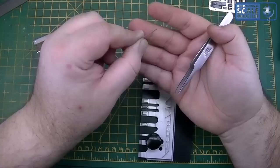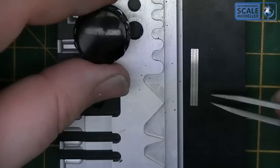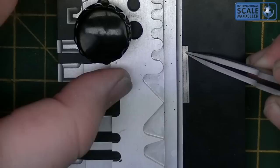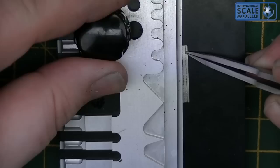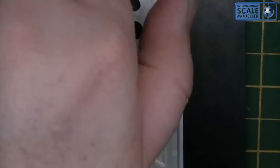So this is where we need to go. I need to try and keep you guys in shot. It's a case of lining up those perforated holes with each side of the machine. What I did was so I could just see the hole. Tighten that side up so it's nearly tight. Push it in so it's straight. Tighten it down, push in the tab more. And the other side, so they're both perfectly the same. Like so, make sure it's locked off nice and tight.